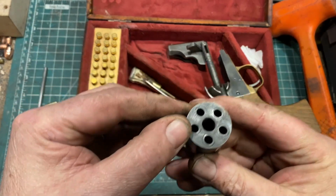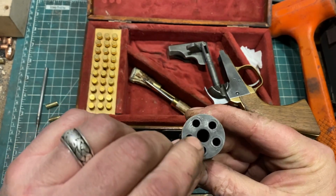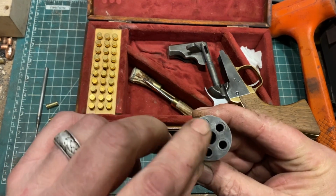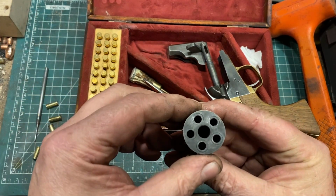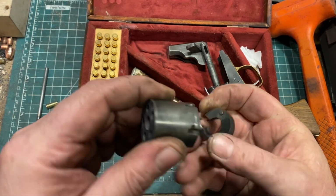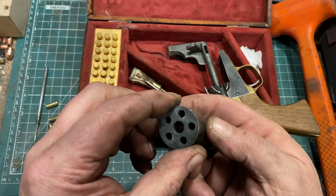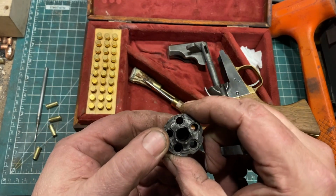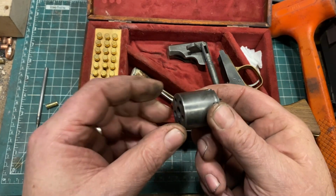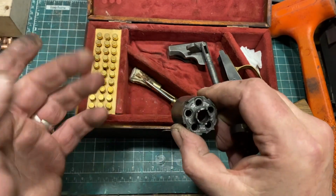And as you can see, what I've done is I've taken a section of .22 barrel and fitted it right into the chambers. The outside diameter of the liner was 5/16 of an inch, which is perfect for these chambers. So they were driven in and secured with Loctite, and then reamed out to .224, and then chambers cut with a .22 caliber chamber reamer.